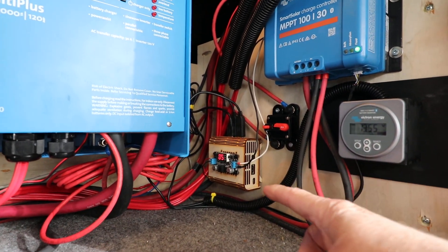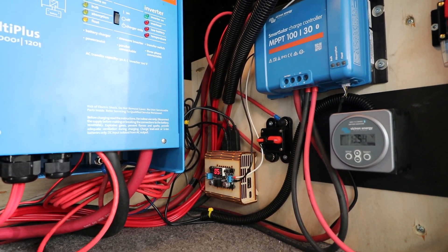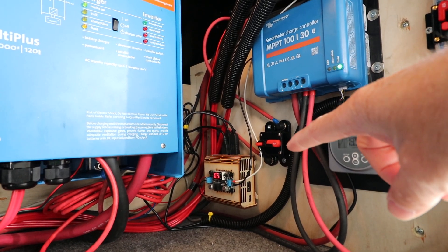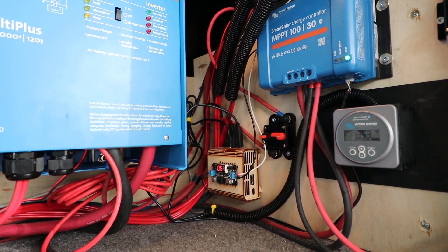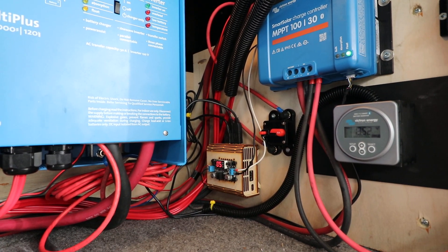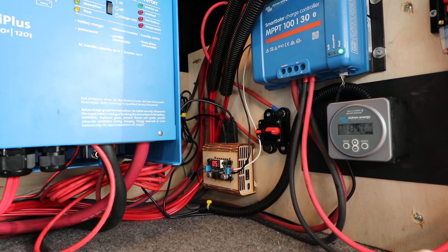Down in the corner there is a custom-made Raspberry Pi 4 control board. What it's doing is providing Venus OS on board, which allows me to monitor both the MultiPlus, the Smart Solar controller, and the battery as if this were a Venus GX device. That little control board on the outside is connected into the 12-volt DC system and converts it down to 5 volts to power the Raspberry Pi.